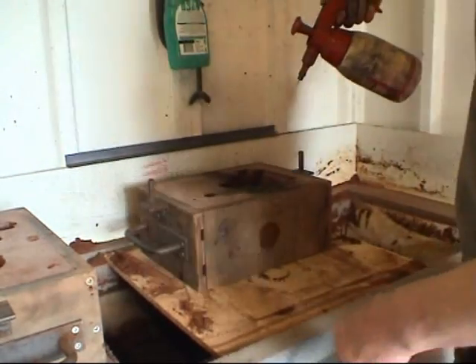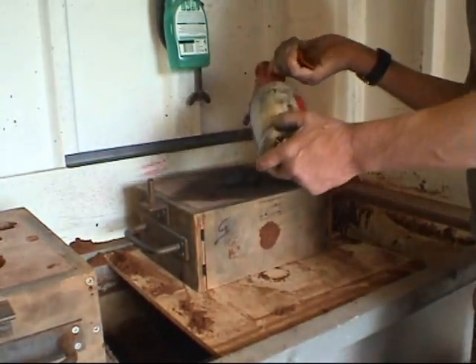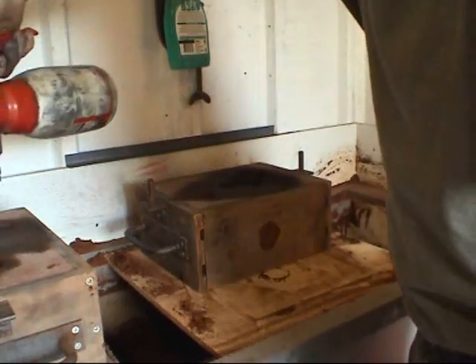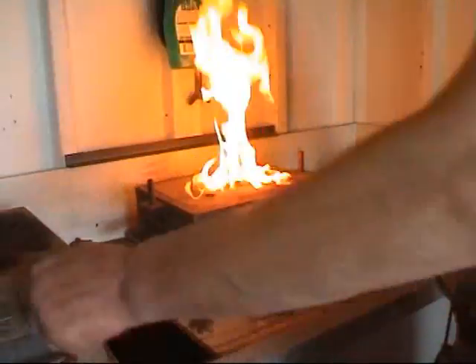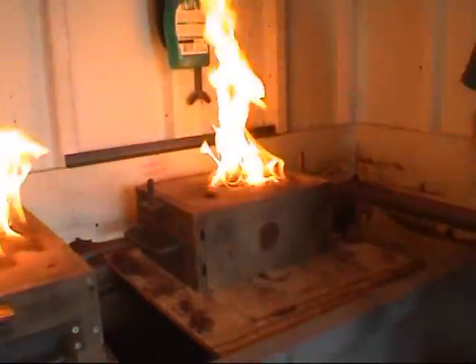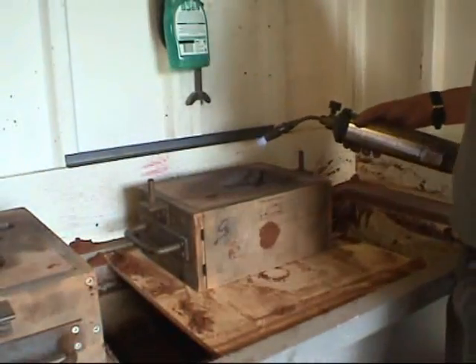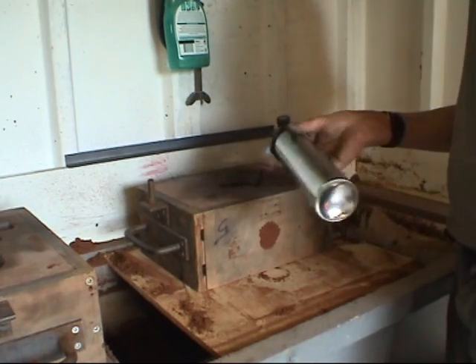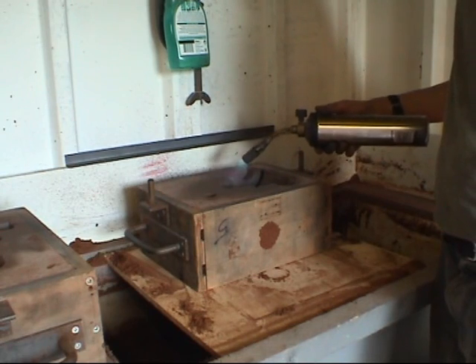I think this is probably one of my favourite bits — there's plenty on. This is then set on fire, as you can see. It burns off the brake cleaner, leaving the mold coated in graphite. The heat also helps to skin-dry the mold. I'm actually using a propane torch here just to make sure the surface of the mold is nice and dry, because the sand wasn't wet but it certainly wasn't too dry either. So I want to make sure we'll get no steam and get this right.